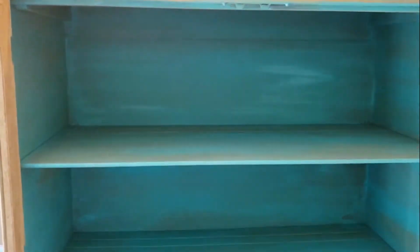This is the first coat, and you'll see at the top it sucked it in a lot, and it's going to need another coat or two. This wood is some of the most difficult wood I've worked with in all of 18 years. So don't get disheartened. These things happen. You just let it suck it in, because it's sucking in the water, the moisture. And then let it dry. Walk away from it. Go work on other things. And then come back to it. And I'm telling you, it's still going to turn out wonderful.